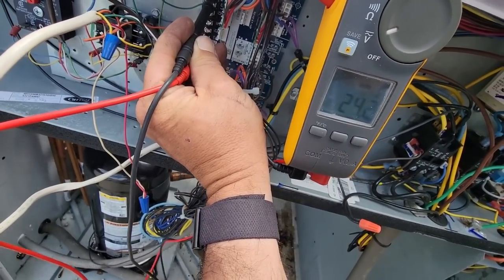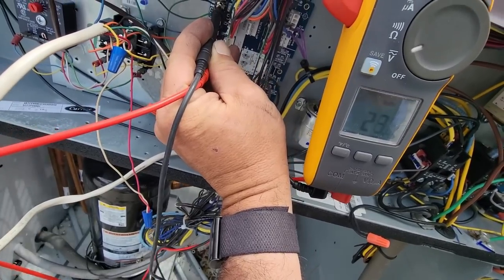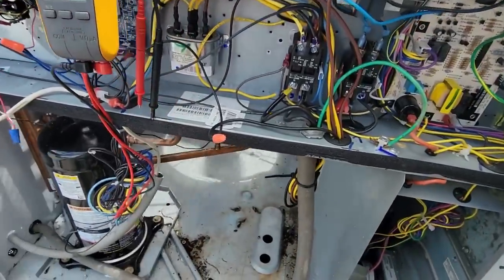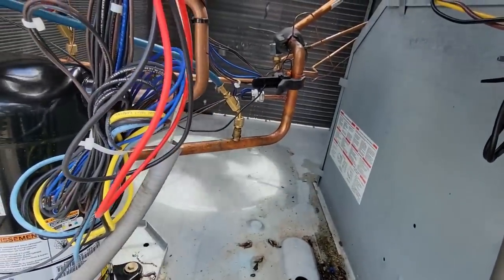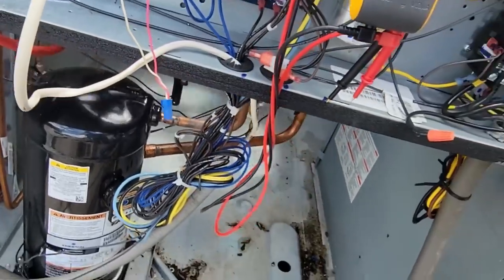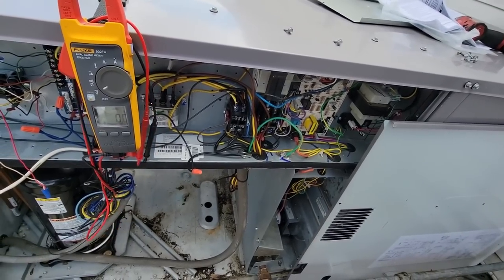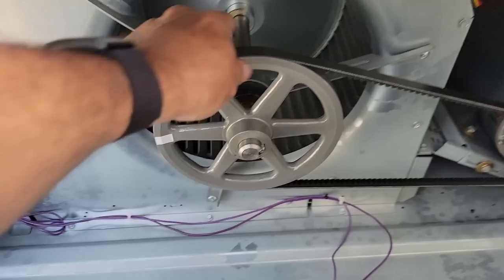And Y1, Y2 — they're both calling. Solenoid does work. I've unplugged it, replugged it, unplugged the compressor, replugged it — it's unloading. So we've got something going on here with the way it feeds. We're going to go ahead and check the RPM of this — it's reflective tape, the tachometer will pick it up. Going through the instructions here, I haven't done a lot with this particular model yet.